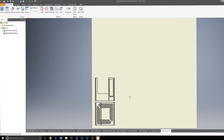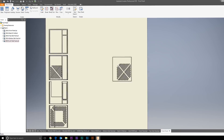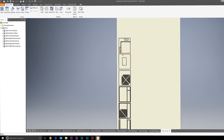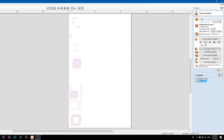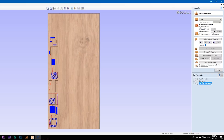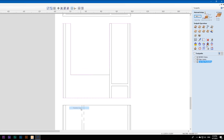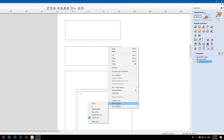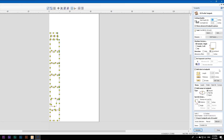After finishing the case design, I laid all the panels out as an Inventor drawing and exported it as a DXF vector file. Then I opened the DXF in VCarve Pro and programmed the CNC cuts and toolpaths. If anyone wants the files to try to replicate this case, I'll have them linked below — but please listen to the changes I would make at the end of this video.